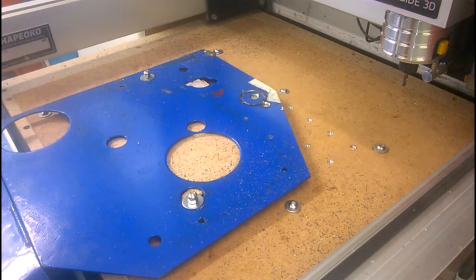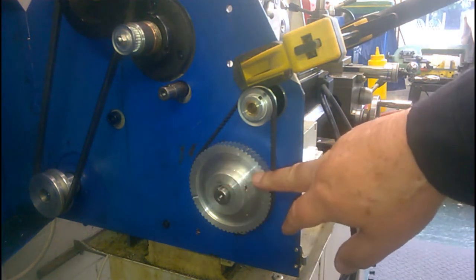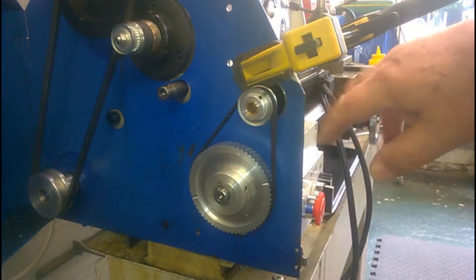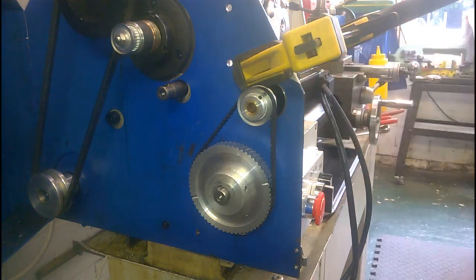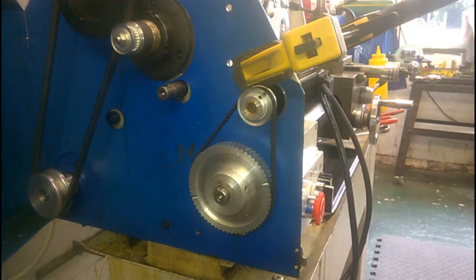The back plate is now back on the lathe. I've put the 60-tooth pulley on the lead screw; the 20-tooth pulley is mounted on the servo hub poking through the newly bored hole. I've held it in place rather inelegantly with this woodworking cramp, but it's holding it in position sufficiently for me to at least punch a centre point through for the first fixing hole, which I'll now drill through, put a bolt through to hold it more securely, and then drill the other holes. I'll do that off camera.